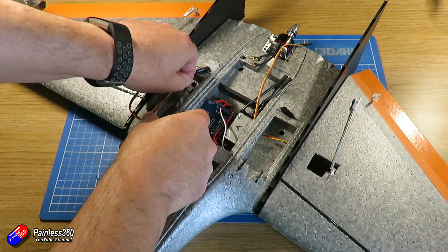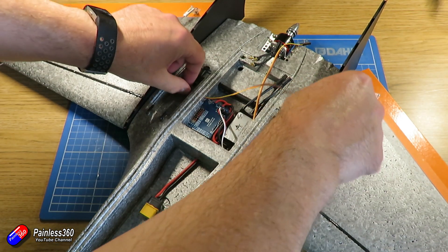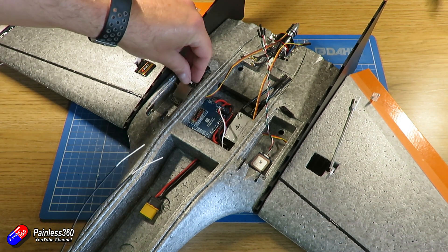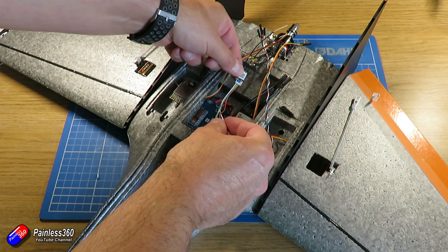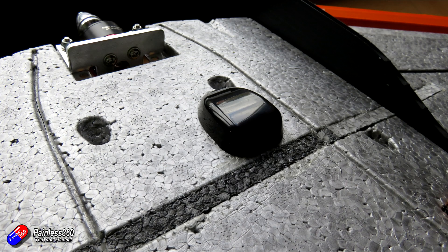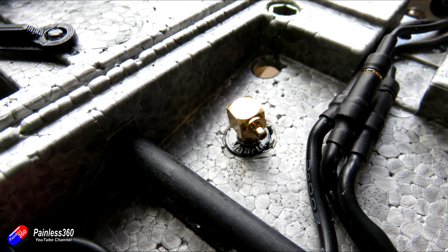When that's all done you can see it fits really neatly into that space. Looking at this, I think we're going to need to put the video transmitter in the left-hand bay as I'm looking at it from the nose, and put the GPS in the other location. The receiver will probably go in behind the GPS as well, with the antennas sticking out the bottom. Now I've got a better idea where everything's going to sit, I can start putting everything together. The antenna I'm using on this model is the brand new Menace RC Aeropod — it's designed to be a much more aerodynamic 5.8 GHz FPV antenna and will sit underneath the model in front of the motor. The little connector inside connects via flying lead into the video transmitter on the left-hand side.